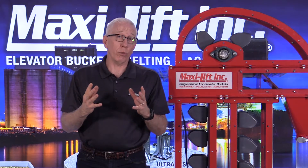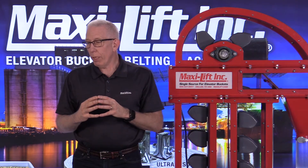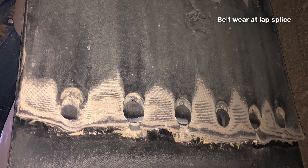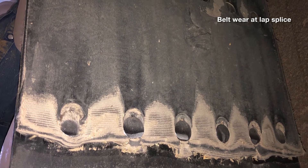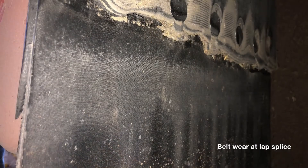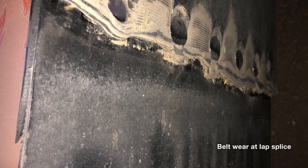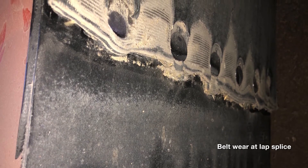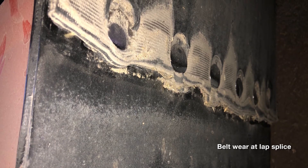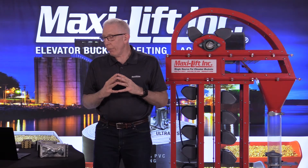It also creates a lot of strain on the buckets. Looking at these photos, you can see this belt has had a pretty tough life. Where the belt comes together, you can see that over the years, as it comes up on the pulley and goes off the pulley, it's hitting that area and wearing it down — that leading edge constantly hitting or coming off the pulley. You can also see how much stretch has occurred; those bolts are being pulled tremendously through the belt because of the years of use. Fortunately in this case, the bolts were sized correctly, otherwise they would have probably broken by now.